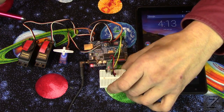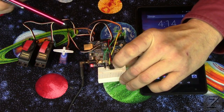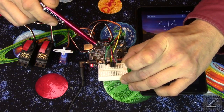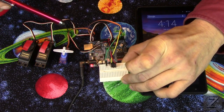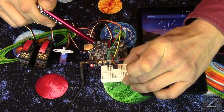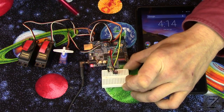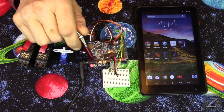So to start with, you can see I got my Bluetooth module. This is an HC06. And then of course I got my voltage divider. And I went through that before in some other videos. You got to use that to make sure that you only got 3.3 volts or less logic coming in to the HC06, and the Arduino board puts out 5 volts, and by using that voltage divider it cuts it down. Works perfect. Other than that, we just got the power, the ground, and the logic in and out, and I'm powering this off a wall wart right now, right through the board.